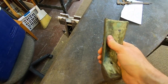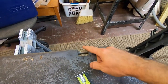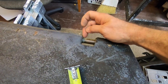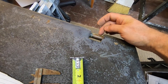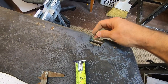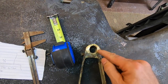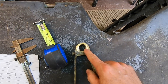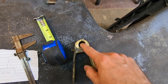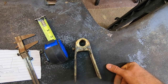Other than that, this thing seems to be in really good shape as far as this goes. I think this rod here was originally three-quarter inch — there's a little bit of meat still left down here that measures three-quarter, and the rest is barely a thirty-second of an inch smaller, so I think this is actually in pretty good shape. But I did notice that this fitting, when I put the bolts back in and pull it together, is a little oblong as well — it varies from about thirteen-sixteenths one way to seven-eighths the other way, so about a sixteenth of an inch difference.